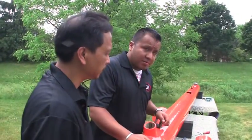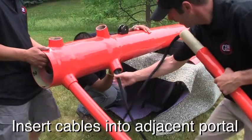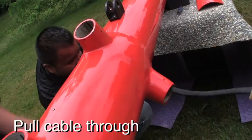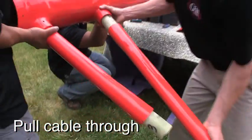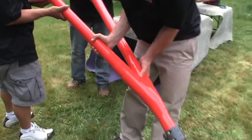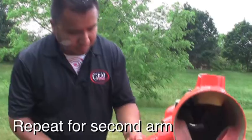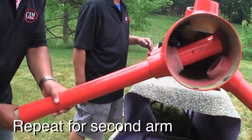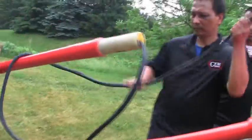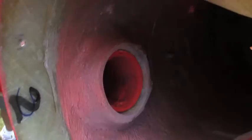Put the cables through the second opening in the fuselage and pull the cable through. Insert the sensor arm and snap it together. Repeat the assembly for the second and third supporting members and pods. It may be necessary when assembling, while tightening the screws, to pull gently on the arms so that the screw holes line up.